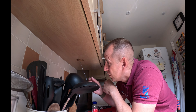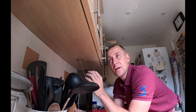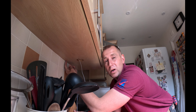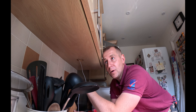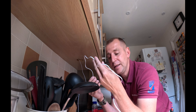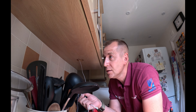Part of being an electrician is you're constantly problem solving. I think what I'm going to do in this case is basically disregard this cable route completely. I know there's a cavity down the back, so I'm going to drill a small pilot hole here and see if I can get that cable routed and then feed my new cable down that way. The way these lights work is they link off each other, and these links aren't long enough to go back up again, so I'm going to neatly clip the cable to the second light fitting.